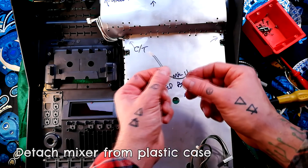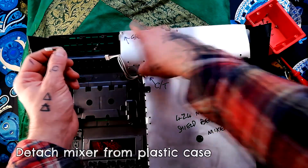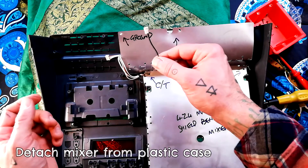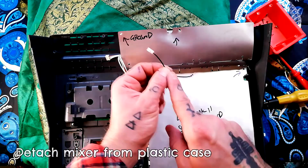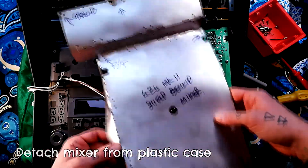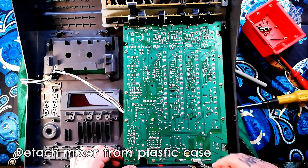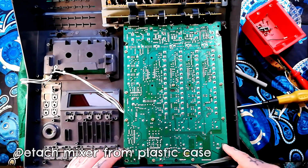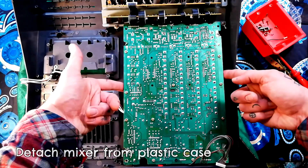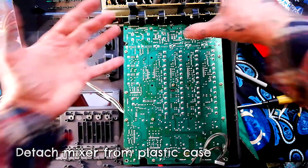Goes without saying, don't lose anything — but in particular don't lose this ground cable that came from there. If this whole board and array of sockets isn't connected to ground, you're going to have buzz and hum. So be particularly careful with this little wire. At that point that piece of foil will just lift out. One thing I will say about this model is it's one of the most solidly constructed ones. When I first saw these metal pins I didn't know what that was about — there's a whole metal chassis on the other side.